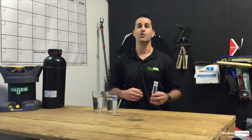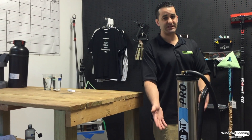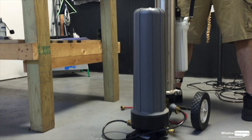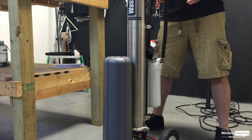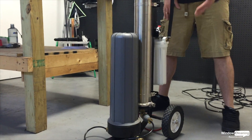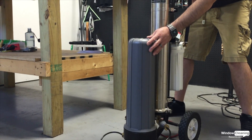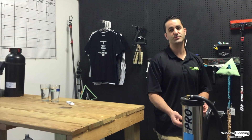If your water is over 150 parts per million and you really want to incorporate pure water window cleaning into your business, consider a multi-stage system like this. It costs more money up front, but in the long run the filters need to be replaced a lot less because of the pre-filters in line. This is a basic multi-stage system with a carbon filter, RO membrane, and DI cartridge — all three of these filters work in conjunction to give you pure water down to zero parts per million.